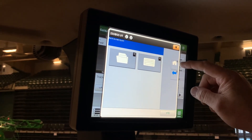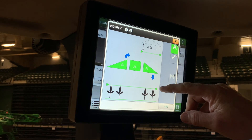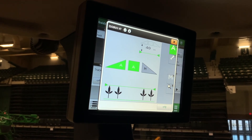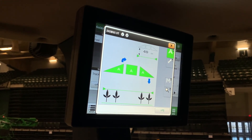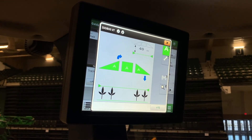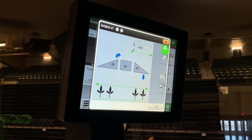That's an overview of the system. We'll put it in automatic — we're now reading in crop mode, with the top and bottom green lines visible. If I raise the right boom only, it disengages just that right boom and I can re-enable it. Same with the left side. If I use the middle control, it puts everything in manual and then I can re-enable it. That's how the system works. If you have any questions on the NORAC system, please contact your local Landmark Implement dealer.